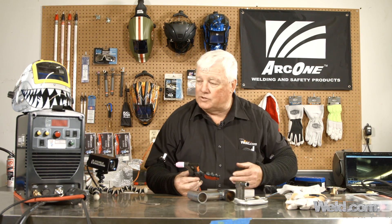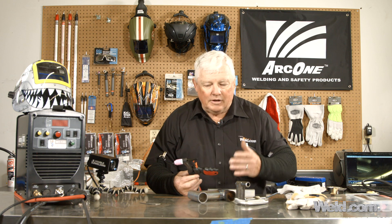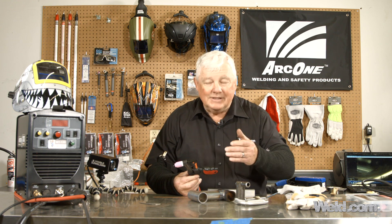You're going to see it says Mr. Tig on the side. I don't manufacture, but I spec out machines to be manufactured. This one was manufactured for me, and I can get about 125 amps DC on this — again, that's just using 115 volts. If you're on AC and you're going to try to get 125 amps, you'll get close, but your breaker will probably trip.